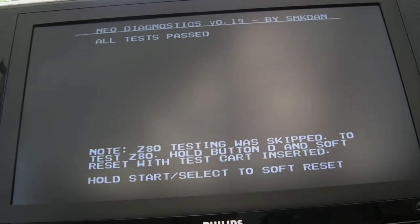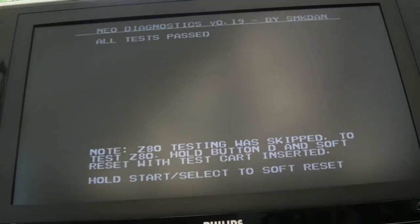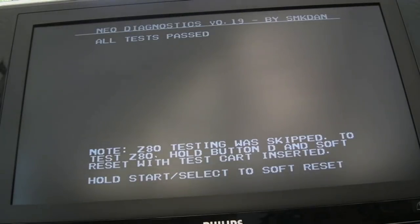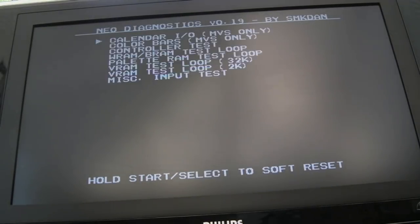In the meantime I thought I'd remove the 259, because the one thing backup RAM and palette have in common is this chip. I can't help but wonder if it's a red herring and we're swapping RAM like there's no tomorrow when all we've got is a problem with the 259. To expand the thought process: the palette bank output, the shadow RAM feature, and the BRAM enable all come from outputs of the 259. I'm thinking it's not latching correctly. So just like that last chip, it should only take a few minutes to get this off. It'd be really nice if this solves at least one of my problems — otherwise I'm in the dark and would need a proper logic analyzer.